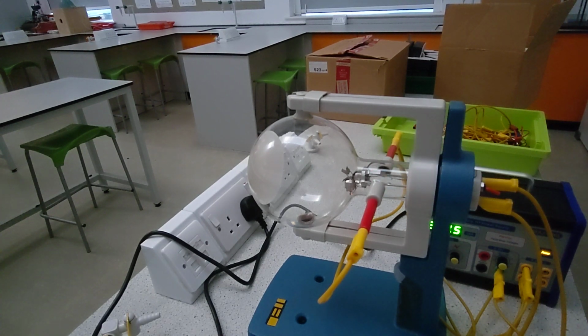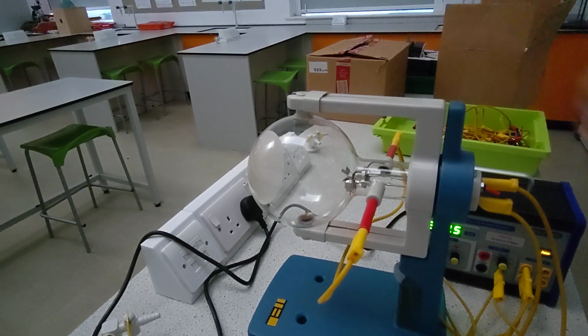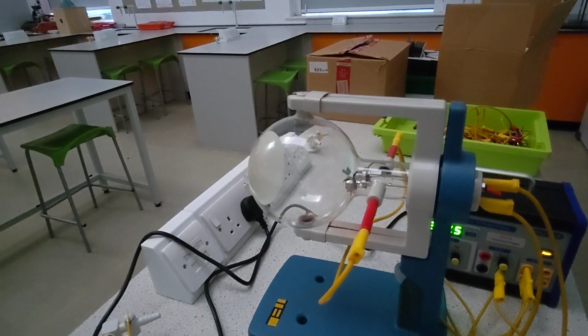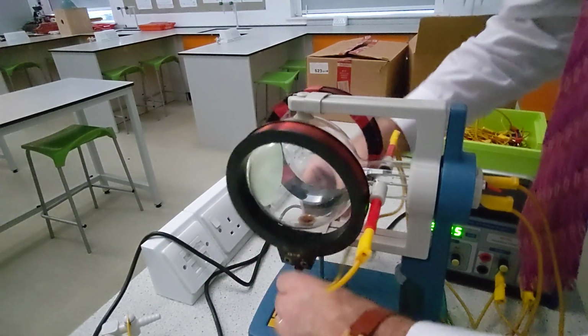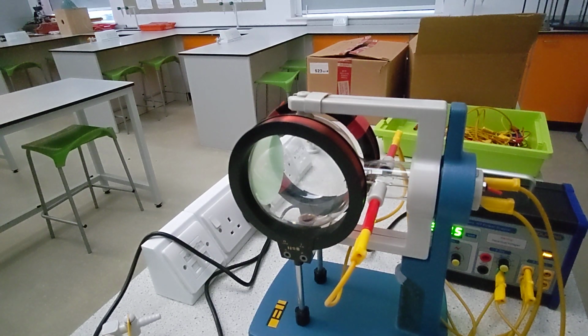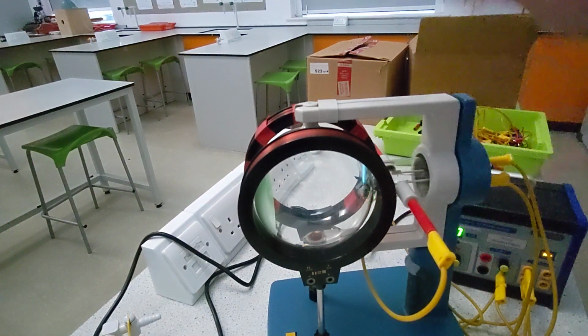It's not going to go anywhere, can't really go anywhere, because the tube is in the way. In fact, you can see a mark on the glass here where the electron beam struck it lots and lots of times. So you can see that actually there. But what I can do is grab my Helmholtz coils. Plug my Helmholtz coils in, just as we did last time. Like that. Can't see what's going on yet. There's just the electron beam going up there, can't go anywhere.